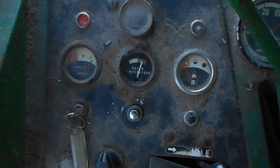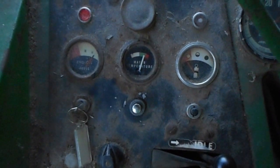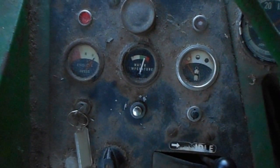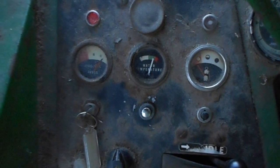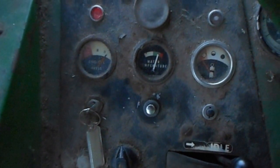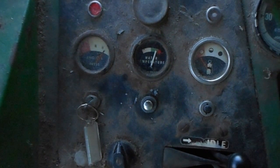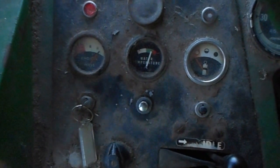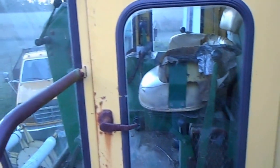Been wondering if it's actually dropping some. I'm also wondering if the temperature probe is picking heat up off the exhaust. Don't know, but it's been idling now for 10 minutes. Nothing to do but shut it off. Not what I want to do. I was really, really, really hoping that flushing the radiator would do it.